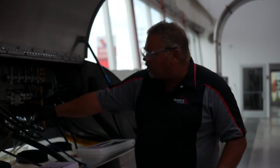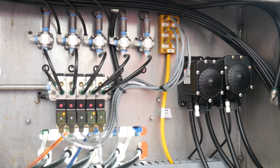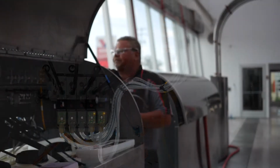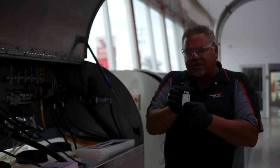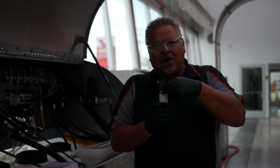Here, the air goes into these different banks of solenoid valves. You can see our yellow Turck block here coming with a patch cord attaches to that solenoid valve. Here is the solenoid valve. This is a coil on that solenoid valve. When our PLC, which is commanding the outputs on in the car wash, turning on different soap functions, sends a message, we energize this coil. That acts like an electromagnet so that it pulls the plunger out, allows air to pass through the solenoid valve. You might want to think of it simply as turning a faucet off and then on again.